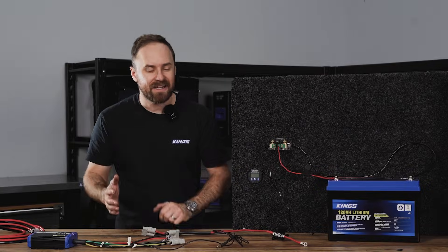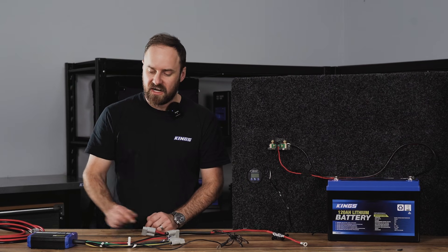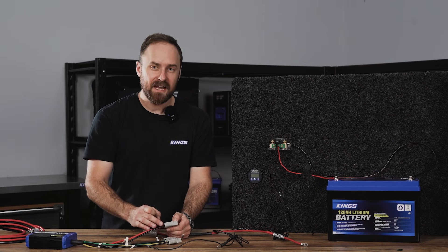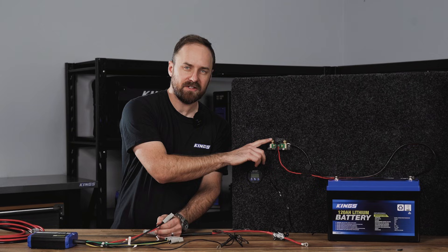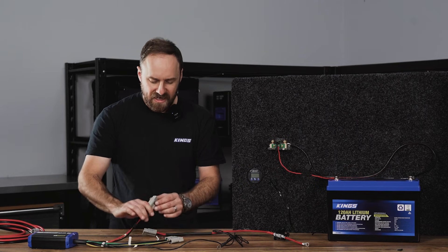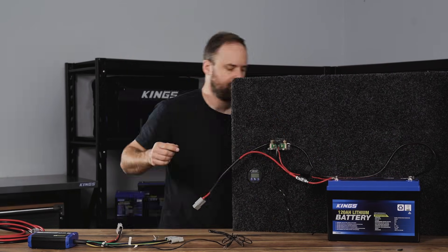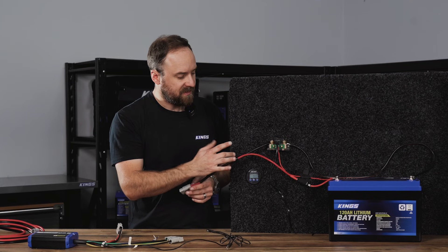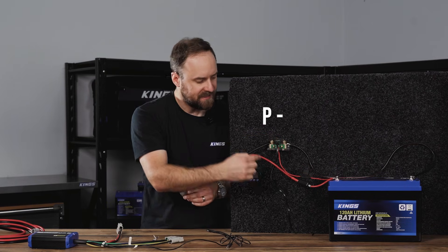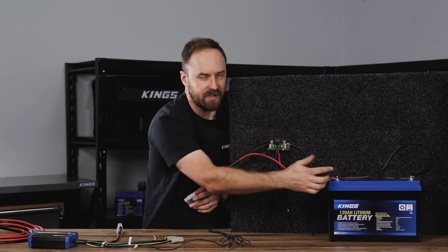Let's talk about how to connect your products to the product negative end of the shunt. In this case I've got a 25 amp DC-DC charger. These come pre-fitted with quick connect plugs, so you could remove those, add a 10 millimeter ring terminal onto the negative wire and connect it to this side of the shunt, and an 8 millimeter ring terminal to the positive wire going to the battery. In this case I'm fitting another quick connect plug with ring terminals already added. I've connected the negative of the quick connect plug to the P negative, or product side, of the shunt, and connected the positive wire through a fuse to the battery. Of course I would add heat shrink if this were a real setup.